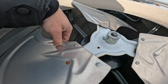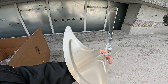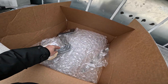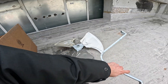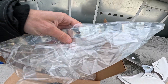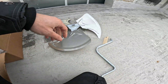So today what we're gonna do is replace the brackets and the fan blade and we should be okay. Got a brand new fan blade here - this is directly from the manufacturer, this is a Johnson Controls part. Then we got the fan blade brackets. I know only one of them was broken, but I picked up brand new ones, all four, because we might have lost some integrity there. And I brought this just in case - this is the belly band that goes around the motor. So we got everything brand new, original parts from the manufacturer.